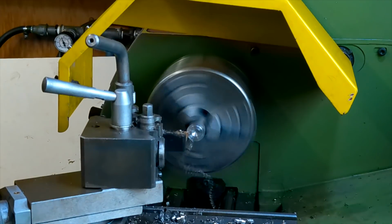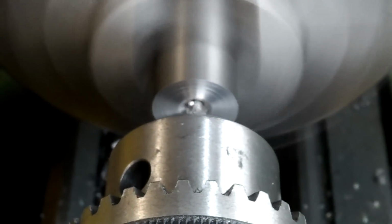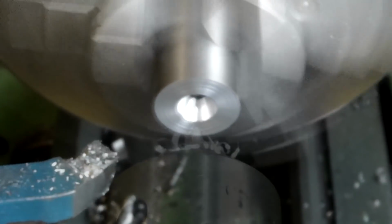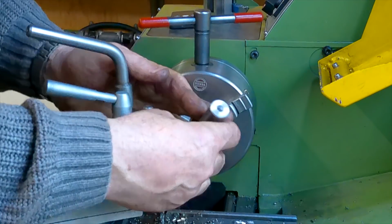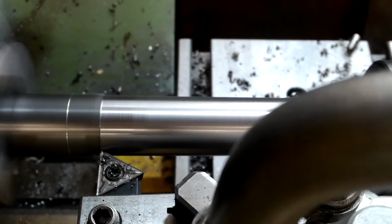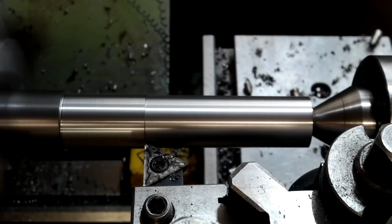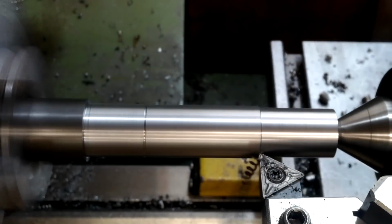After grubbing through my box of offcuts, I found some material suitable to make a mandrel. I end-drilled and centred the mandrel on both ends, just in case I had to turn the workpiece round between centres at a later stage. The first and second spigots were cut to support the roller and to keep the outside face concentric to the bore.